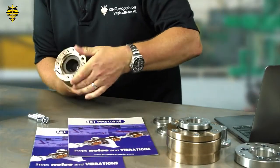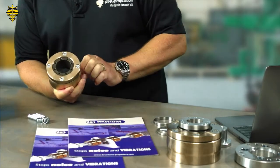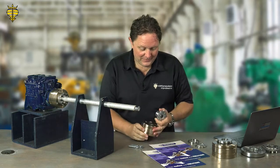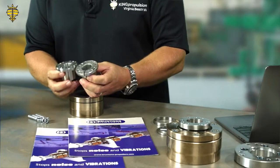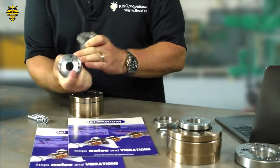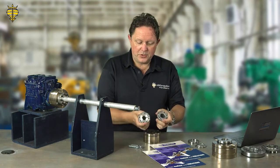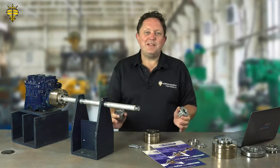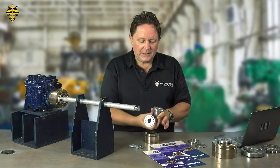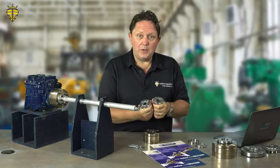There's a stud system — four studs, slides on. On the other side, this is empty at the minute, and we come with a unique system called a taper lock collar. The taper lock is a very efficient method of connecting something — it uses a taper to squeeze a slot together. This is used on cruise ships, container ships, and military vessels. The main point is it's a keyless system. The key puts a point load on the coupling — this one has a 360-degree grip and it's not designed to fail. It's not supposed to be a drive saver. This thing will grip like you have no idea.